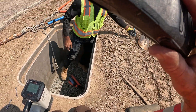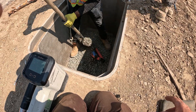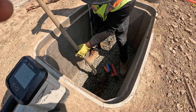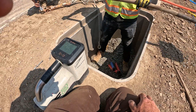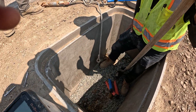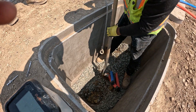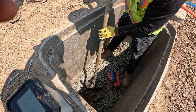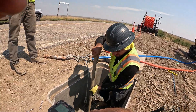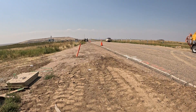Make sure your water's off. There it is — you found it. Dane, rotate it and then pull it back like six inches. Rotate it fast and pull it back a little more. Stop. What we've got to do is uncover the drill head and hook our swivel on with our pipe, then pull it all the way back to Dane — which is about 220 feet.